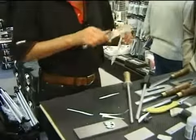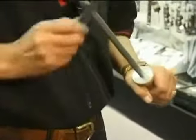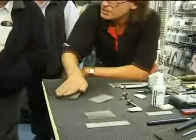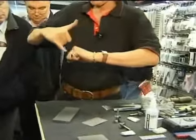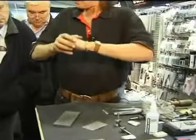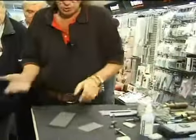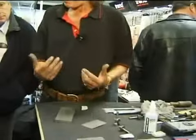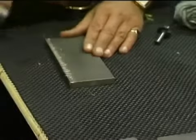Now, once you've got it like that, to maintain it, all you're doing is this. That's enough. If after a while that begins to look mucky, and you attract swarf around the top of that diamond, you're going to take away a little bit of the abrasion. That's why it comes with the cleaning block. It's like a drawing office rubber. And the good thing about Continua is it cleans down really easily. It cleans out that easily. So maintenance-wise, it's superb.